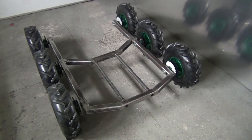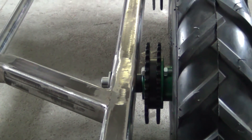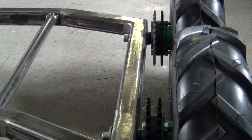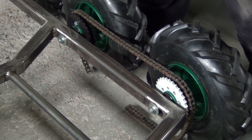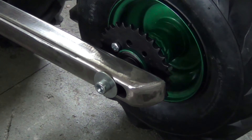Okay, there we go — the wheels are bolted back to the frame and all the sprockets are in place. I still need to cut down some of the bolts since I didn't have the correct lengths for all of them. In the back we have one sprocket only, in the middle one, and the front one we have two. The drive will connect to the front wheel and from there it will be passed to all of the wheels on the side. Adjusting the tension for the chains will be handled by moving the axle in the slot.